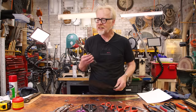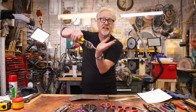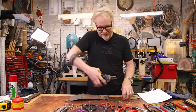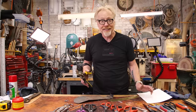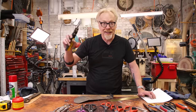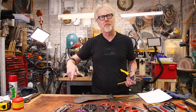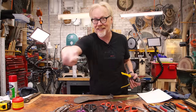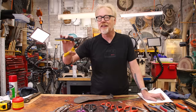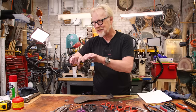Here is a piece of steel — I'll cut this also with the tin snips. You need strength behind it, but you can also see how much sensitivity you can bring to the cut. The differences between snips are sometimes in the angle of attack on the head or the direction it faces — all about giving you the right access to the metal. Terry English told me that all 107 suits of armor he cut for Excalibur were excavated out of sheets of aluminum using scissors just like this. You can make a whole suit of armor with these.